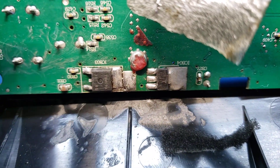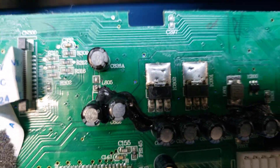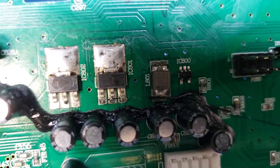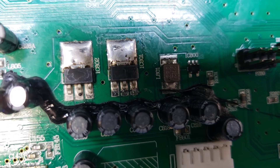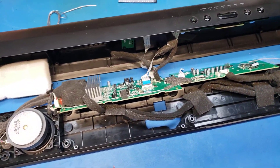Solder them into place and your audio is back. You can put the L806 bridge in on the front side if you want, but all you're doing is putting more load on those regulators and not fixing the real problem. Just wanted you guys to see that — thanks.